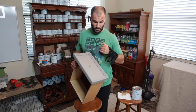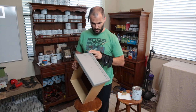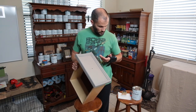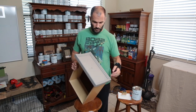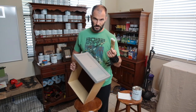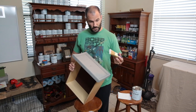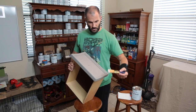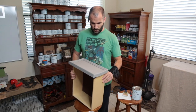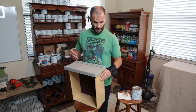People really enjoy having something unique and different all throughout the piece — some parts will still have white, some won't. For this next step I'm going to zoom in so you can see just how the dry brush happens, because from a couple feet away you might not see how gently you're going to do it. You just need a small flat brush — straight style rather than the fan style — because you want better control for gently dragging across. Then after this it'll be distressing, and then clear and dark wax.